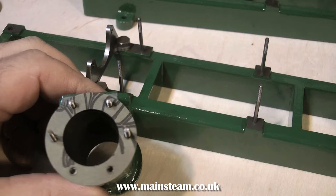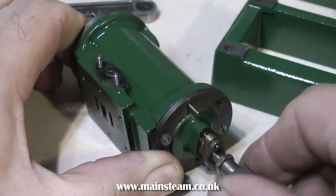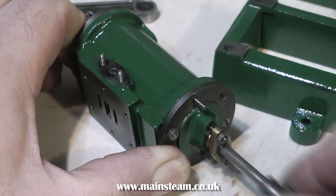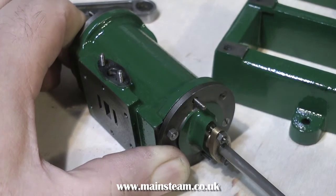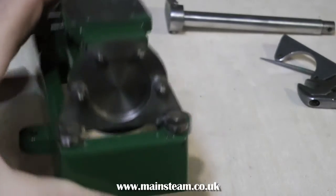In this shot you can see the studs are in place, and the two missing ones at the bottom are for the countersunk bolts. Here is the cylinder with the covers attached. This cylinder was the one that I remachined, so it's good to see that it moves very freely — no binding, no tight spots, and it's parallel all the way. And here it is fitted to the engine.